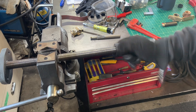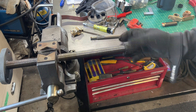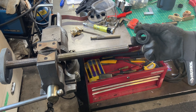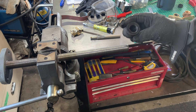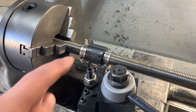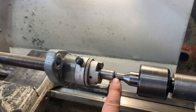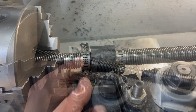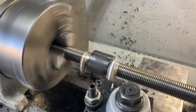Now that part is done, but there's still more work. At this point the external diameter is not round — it's not concentric with the middle. I'm going to have to put it in my lathe to turn the outside diameter. I put the lead screw into my three-jaw chuck at this end, drilled a 60-degree hole, and I've got a live center so it'll turn. Taking very light cuts — 30 thousandths — with clips in place. You've got to be careful.